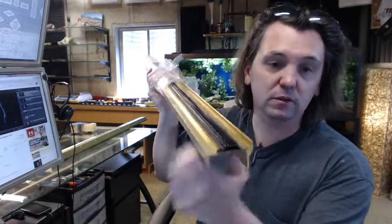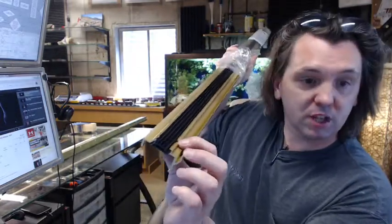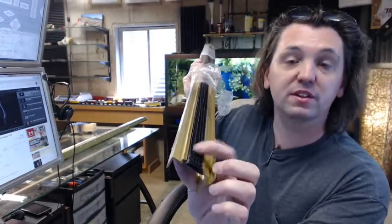There's an image below this video showing the important dimensions. This may deviate a little from that image, as solid bronze extrusions are typically less common than aluminum products. Regarding the part number: the 216 is the door bottom style; you can get it with an aluminum or bronze base — the B stands for bronze. The V means the seal material is vinyl, a standard-duty item. The small dimple you see here is purposeful — it holds the seal in place so it doesn't slide out from where it's supposed to be.